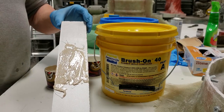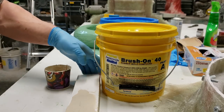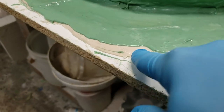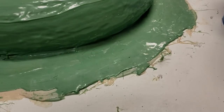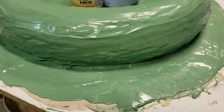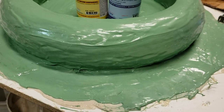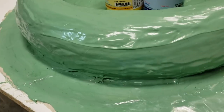You let that dry, come back 25 minutes to half an hour, touch it - if it's sticky but doesn't come off, you're ready for the next coat. I'll grab this so you can see the coloring. They recommend alternating coat colors - so your first coat is the natural color, and then the next coat to ensure good coverage, you put a dye in. I tried clothing dye on a test piece and it didn't work well, so I use iron oxide powder. You need less than a quarter teaspoon - even half of that mixed in really well gives you the color so you can see that you've got good coverage.